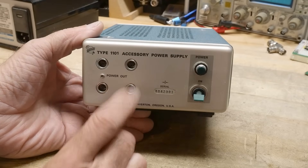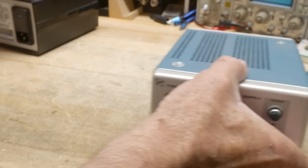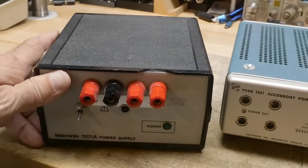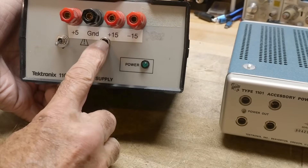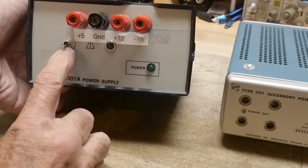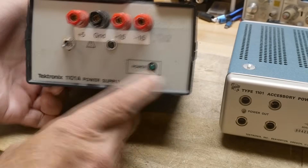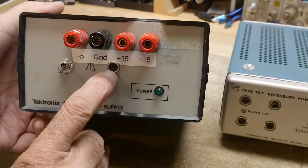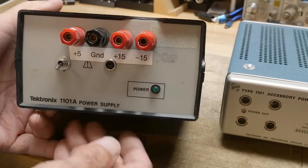This one has four connectors — that's just pretty. I've never seen one that had four; I haven't seen one this old. I have one, but this is obviously a much newer generation. Mine's been modified — I put BNCs on it. I had the box with just two of these connectors, left one connector on, used the other hole to put in a power switch, and turned it into a multi-purpose power supply. This little connector has plus 5, plus 15, and minus 15 all on that one connector.